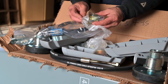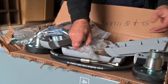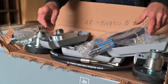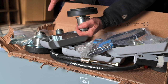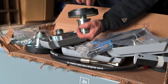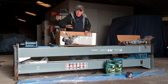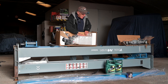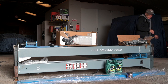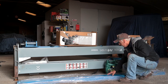We've got the electromagnetic relays which will disengage the lift when it needs to descend. And you have the adjustable foot that you can put on the arms so you can actually adjust the height. In the other box you will find the motor unit, which is the hydraulic pump and the reservoir. And then finally you will find the cover panel that goes on the floor.